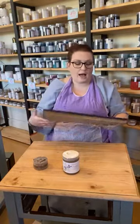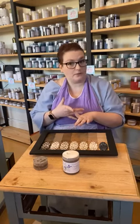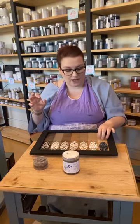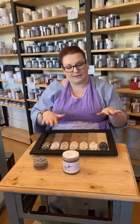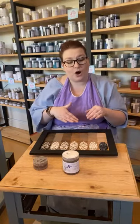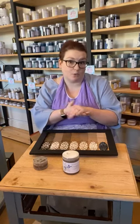Whisper is our white. If you are doing pine furniture and just clean coat it, it's often going to come back with that orange and yellow. Going in with a coat of Whisper will neutralise a lot of that yellowness and orangeness of the timber. Driftwood's also really nice because it's such a pale brown and it can neutralise as well. Because these are all water-based, if you find it's too dark straight out of the jar, you can decant some and thin it down with water.